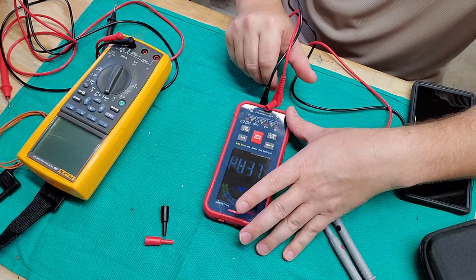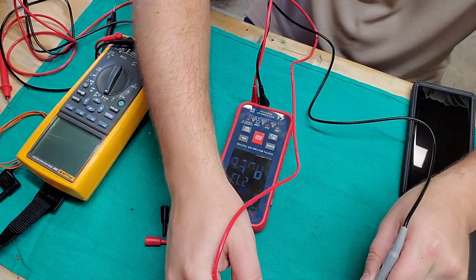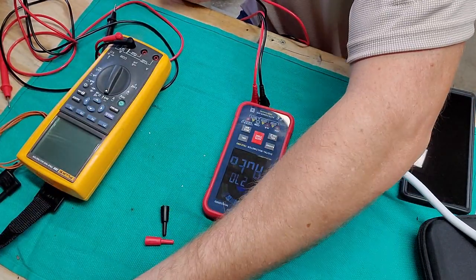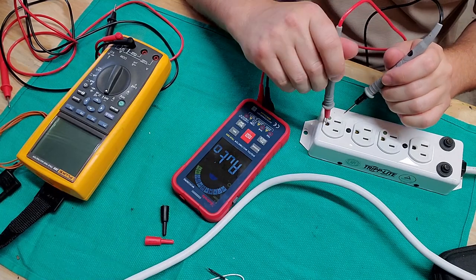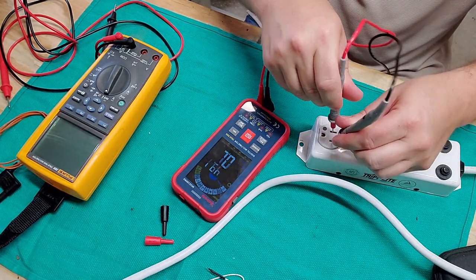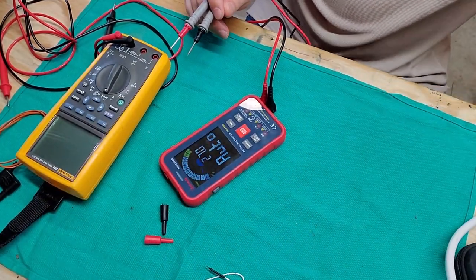In smart mode it's just flipping back and forth. I pop it over on this battery — bam, 1244. Let's see what it does with my isolation power strip. Isolation power strips should be half the phases on one side, half on the other, relative to ground. We're getting 43 volts to ground on one side, 34 volts to ground on the other, and 125 to 126 volts across both prongs. Obviously you're going to get a varied voltage out of an isolation transformer, especially one that wasn't wired to be an isolation transformer like mine.